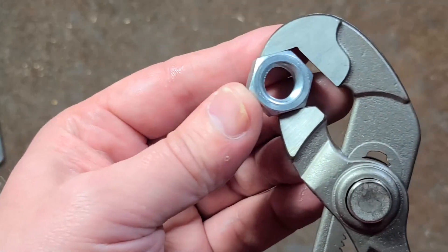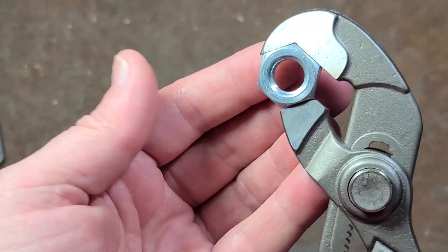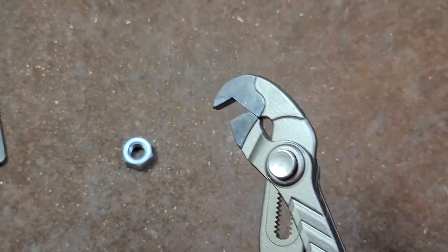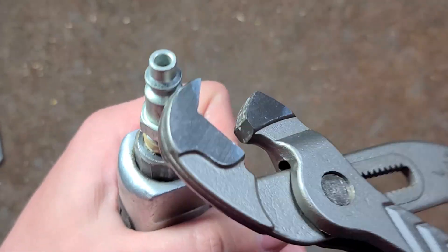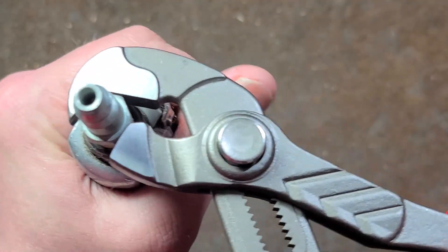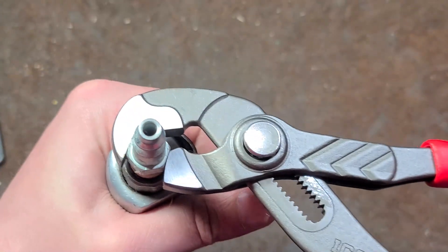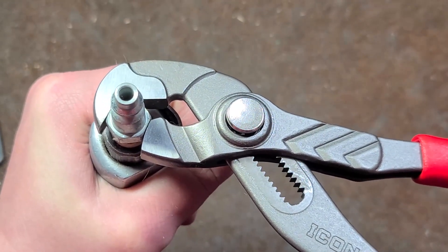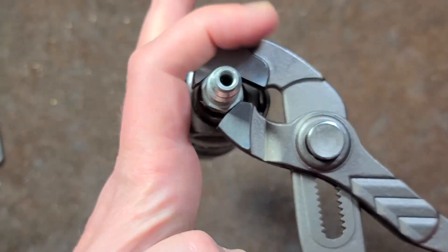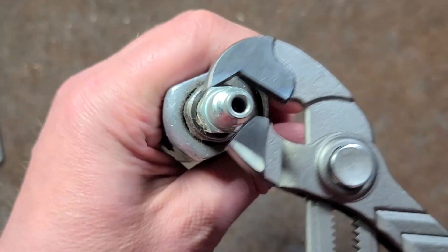The idea with this jaw being like this is so you can kind of slide it right onto the fastener in tight access situations. But I think that kind of defeats the purpose a little bit. And what I mean by that is — this is a pretty simple test — I'll put this on in the proper direction here and start tightening this up. Now I actually have to put a fair amount of pressure on these hand grips to really keep this. Because if I don't, as soon as I start releasing — see what wants to happen? The fixed jaw just wants to slide off the top, where if it was just tilted a little bit more, it may have been a little bit more difficult to get onto a fastener in a confined space.